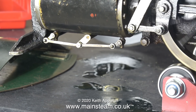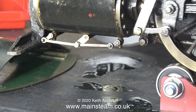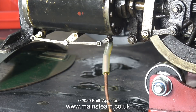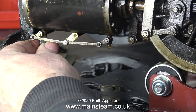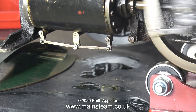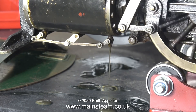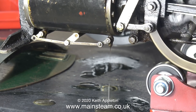The drain cocks are working fine. To check the drain cocks on the other side I had to move the engine off the bench onto the bigger bench. The back drain cock was blocked but the front one was okay. For a more thorough test I'm injecting quite a lot of ordinary lubricating oil into the cylinder using an oil can designed for inaccessible places. The engine didn't like having so much oil in the cylinder, but with the drain cocks open the oil is coming out — a very dirty black color — and the more I ran the engine the dirtier it got.